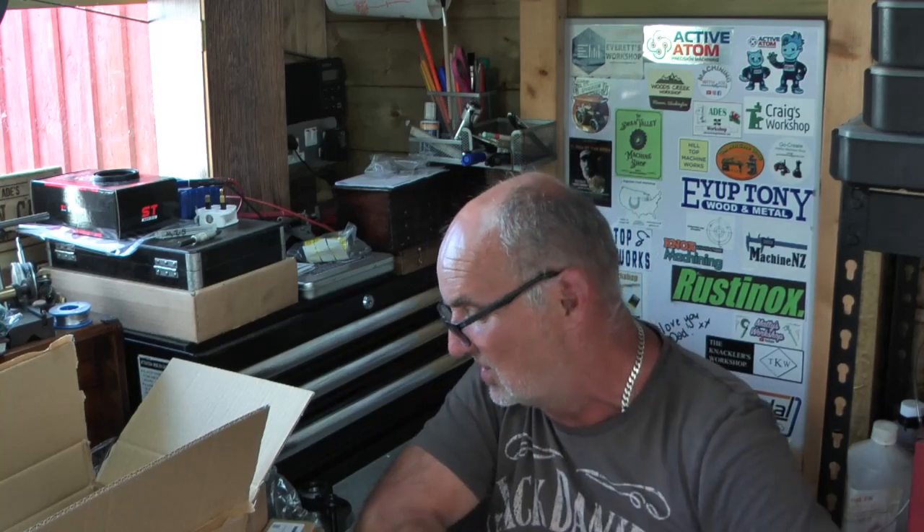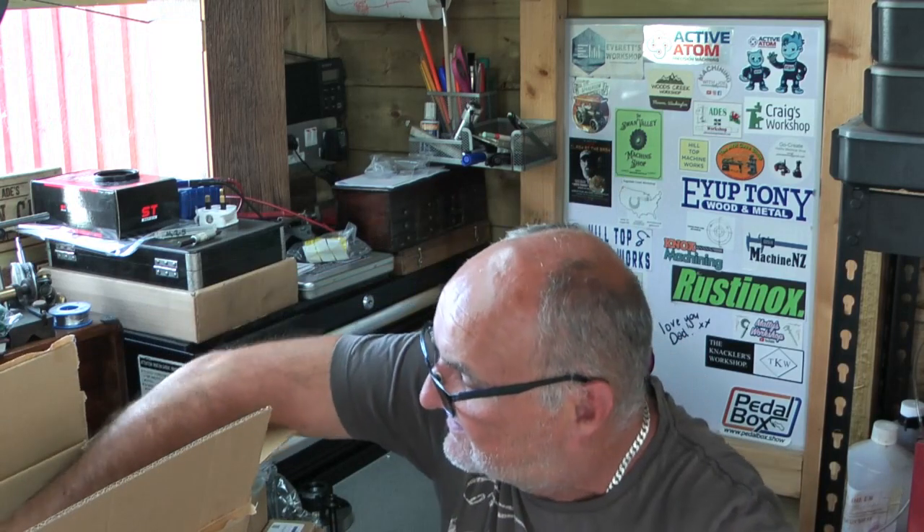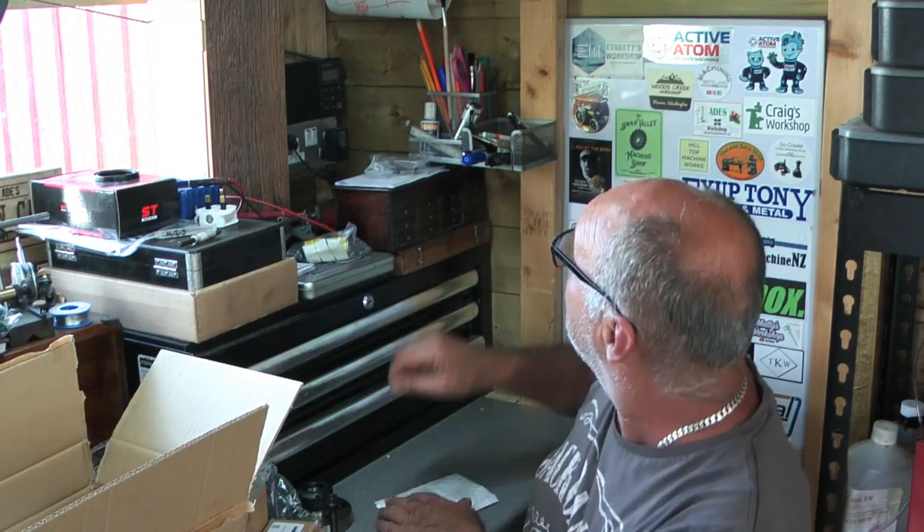If you're a regular viewer, I manufactured a riser block — a compound slide replacement. I machined this rectangular block to the correct thickness, the same as the original compound. I'm going to have to get this fitted in the right location and then machine some slopes and angles. As this lathe is only going to do light work, I think I'll leave it so it can be rotated rather than keying it into a square position — it gives it a bit more versatility.